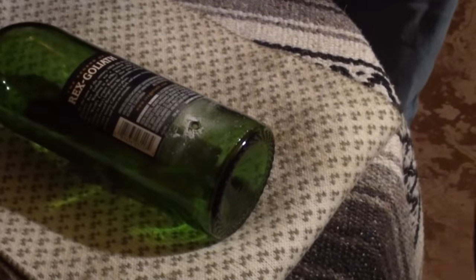We've broken through the glass now. Once you're through, things start to pick up speed-wise. Again, I'm keeping a constant slow speed. I'm not putting much pressure on this. If you feel it starting to chatter, you want to slow up a bit too. You don't want the glass to get too jagged or you'll break it for sure. There, we're through with the first drill bit now, and I'm going to move up to our next size.